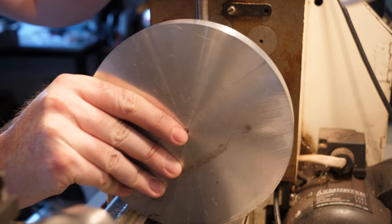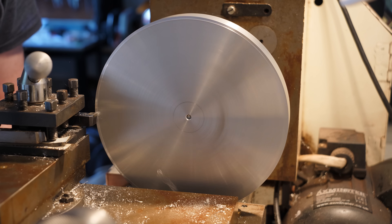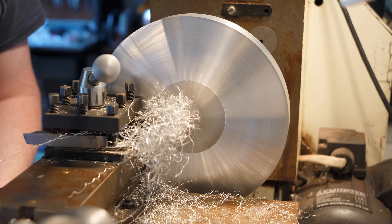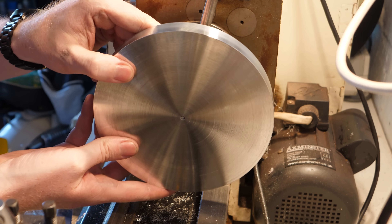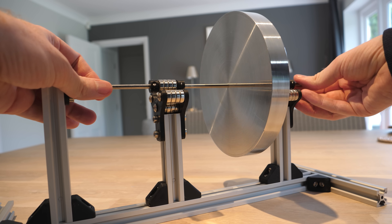The flywheel can then be machined out of aluminium for two reasons. The first is it's easier to machine than steel on my grandad's lathe, and the second and probably most important reason is that aluminium isn't magnetic, which could cause issues with the levitation. Even being aluminium it still weighs about 1.4 kilograms, which should have plenty of inertia.